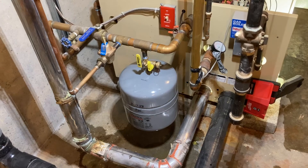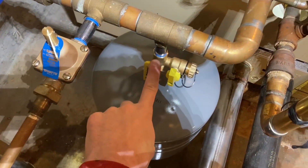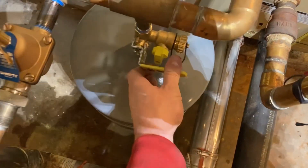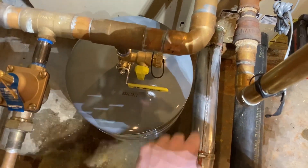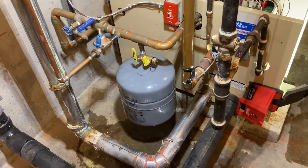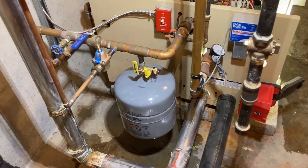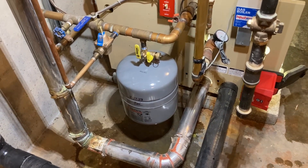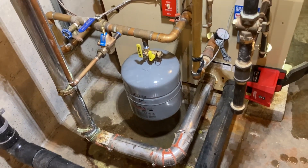If you don't want to drain the whole boiler, what you can do is what we do — we put an isolation valve with a drain on there, which allows us to isolate the tank, put a hose on the hose port, and open it. That'll basically purge the tank and then we can check the charge from the bottom. If you check the tank with it still part of the system, you'll just check whatever pressure is in the system. If it's 12 psi, the tank will read 12 psi even though the pre-charge might be zero.